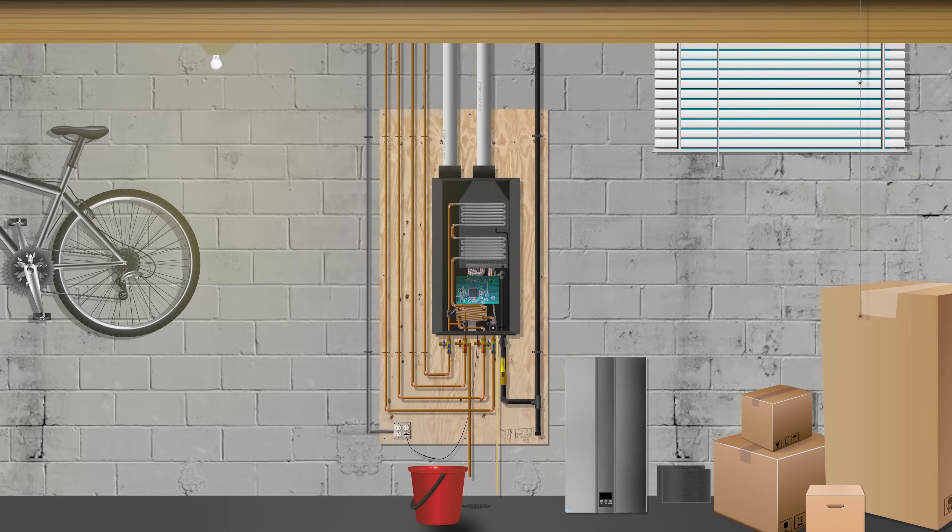To finalize the maintenance step, there's a condensate trap located at the bottom that every once in a while needs to be drained, due to the system heating up and cooling down as there's a demand.